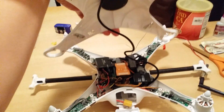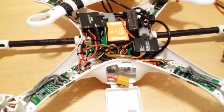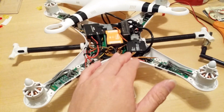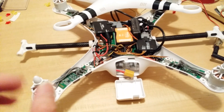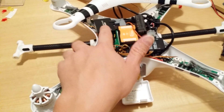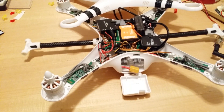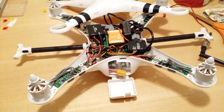That was a quick look at my Phantom and how I installed everything. There's not a lot of space to work with and it's already pretty heavy — the current all-out weight with the battery, minus the Zenmuse gimbal, is about 908 grams. That includes motors, props, IOSD, full-size receiver, GCU, and the mount itself, but no gimbal. With the gimbal it'll run up to about 500 grams more. Hope you guys enjoyed it — thanks for watching.